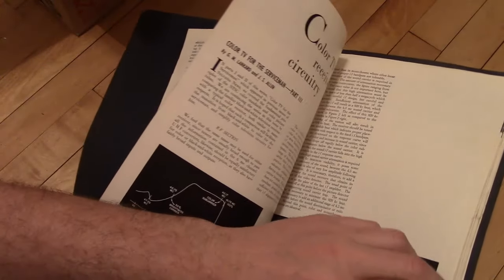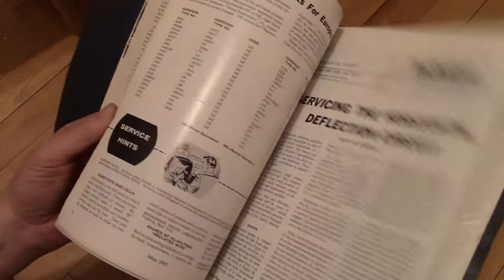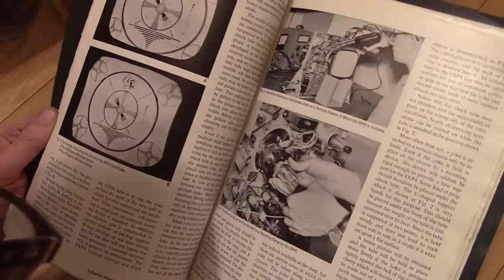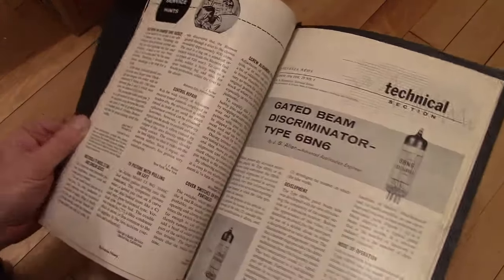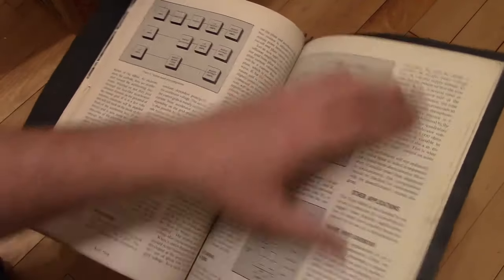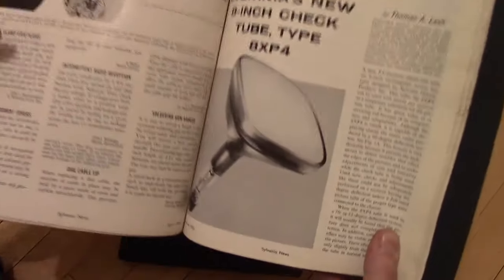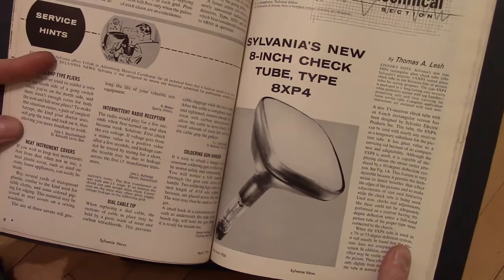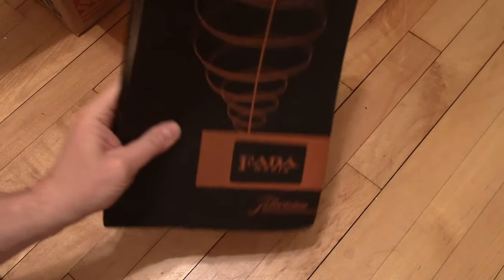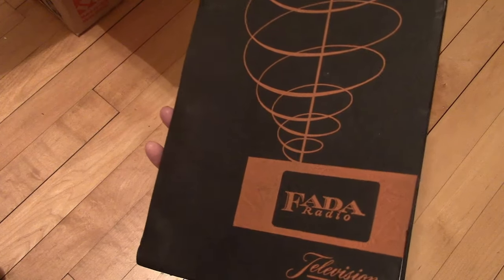And stuff about early color TV circuitry — this was definitely well worth the purchase; I've never seen a lot of this info before. Now they're talking about the 8XP4 — that is the early test CRT for rectangular picture tubes, which you've also seen me use most recently in my Dumont RA113 restoration. Introduced in '56. The point of using those is you don't have to have the big picture tube that's actually in the set — you can use these little 5 and 8-inch CRTs in lieu of them, and they're rugged and meant to withstand if the voltages are off without ruining them.